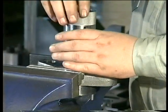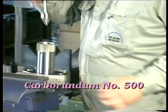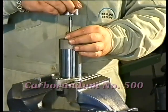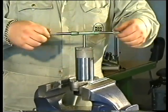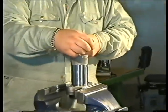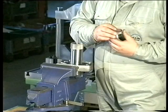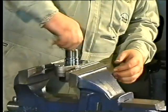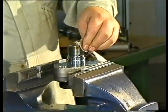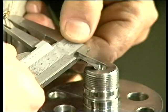Use the milling or grinding tool if more serious damage has occurred on the seating surface for the high pressure pipe in the valve head. The diameter of the seating surface must not exceed the value stated in Procedure Number 909 in Volume 2 of the Instruction Book.